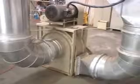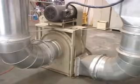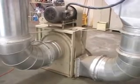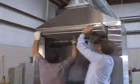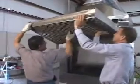A centrifugal fan is recommended to pull air from the Humidaire unit. Place the fan far enough from the Humidaire unit so that there is no interference when removing the mist eliminator and other serviceable components on the machine. We recommend a distance of about 6 feet.